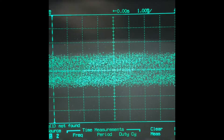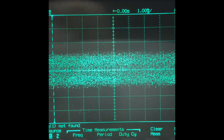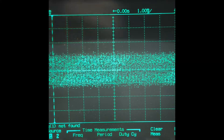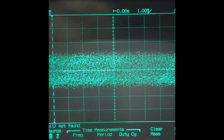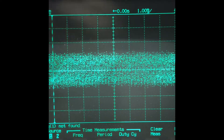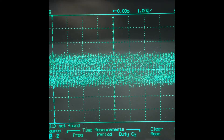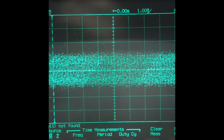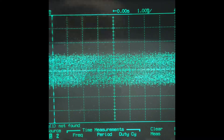Hopefully you found that helpful. I'll probably substitute a .01 microfarad cap in the radio. The .016, approaching .02, just sounds a little muffled to me. I think a better sound for this particular radio would be around .01 microfarads. It's subjective, but here you can see the difference it makes.